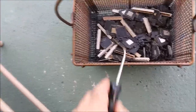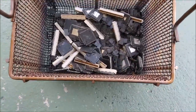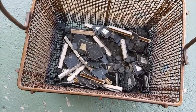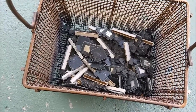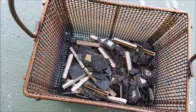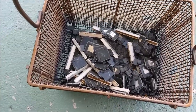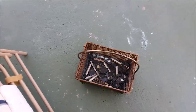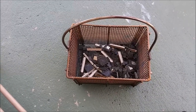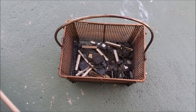These are going to cool down and then I'll sort them. I'm going to process the chips by type because these big memory controller chips have a lot more gold in them than the RAM chips do. On the other hand, the RAM chips have a lot less packaging. So ratio of gold to packaging, I'm not sure which is higher. But I know I'm going to get a lot more gold from processing those 40 memory controller chips. This is just a batch of 10 cards - I've got another batch of 10 to do and I did a batch yesterday, so I'm going to get a lot of gold out of this project. This shaking-the-basket depopulation method in the kiln worked like a dream. I think I'm going to hold off on trying to build a trommel depopulator for now. Thanks for watching.